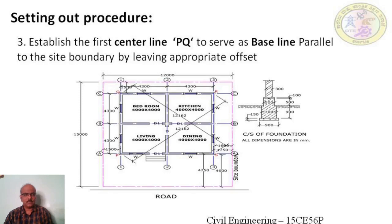Here you can see the setting out drawing. In this drawing all grid lines are marked — 1, 2, 3, A, B, C are the vertical and horizontal grid lines — and distances between these grid lines are also shown. The diagonal length is calculated by the Pythagoras theorem and both diagonals should be checked at the end. The offset of the building's outer line from the boundary line and from the road is also marked. To start with any corner, the corner point has to be marked by referring the offset from building bylaws.